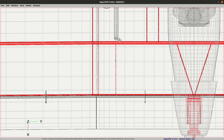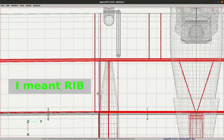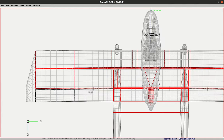Let me pop up the tail boom so you can see where that is. There'll be an attach point here at the main spar, and two rear attach points at the rear spar. Those ribs will help carry that torsional load forward to the main spar. On the outer panel, there's also a rib right at the separation between the two panels — to help hold the airfoil shape and to transfer load from the rear spar to the forward spar.